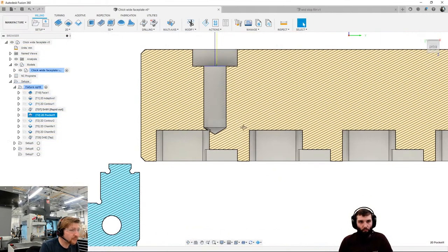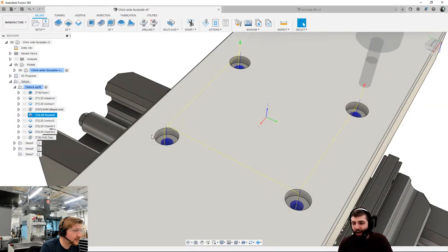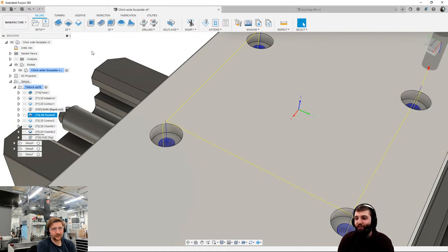I'm then doing my 2D pocket at the top. So, Spence, have people got me the answer yet? I've got you an answer. Has no one else? We've got one comment, which is an interesting one, which is not what I thought. But Andrew said that it centers the hole with the pocket better if you drill it first. Yeah, he's probably right. We're not going to get too much deflection in aluminium, but if it was harder materials, yeah, you are right. It's going to potentially give us problems there with deflection. That's a good point. Didn't consider that.